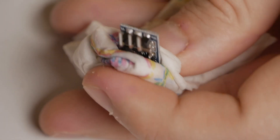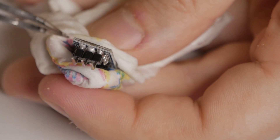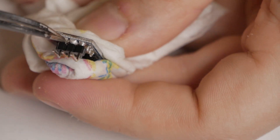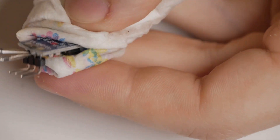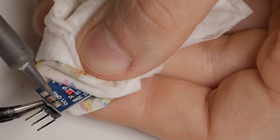This is a trick I always use — there is some space and we need to pop the pins out. What you do is take something springy and put it there, so when you apply heat it will automatically pull the pin out.